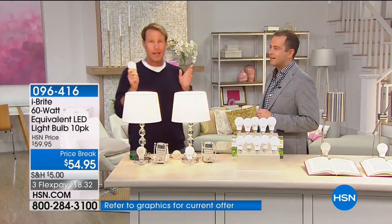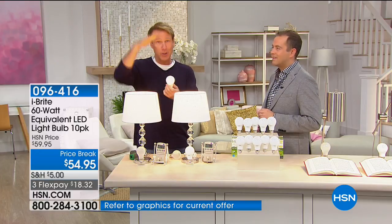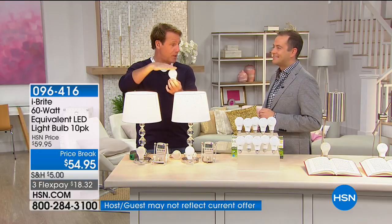Your lighting portion of that is 10 to 15%. So let's keep it conservative. Let's make it 10%. That's $240 per year in lighting costs, right? Imagine reducing that to 36 bucks. Are you serious? That's what you just did. You reduced it 85% to $36.